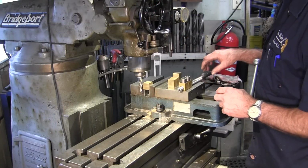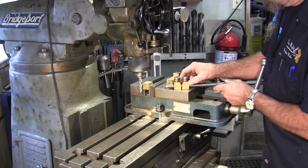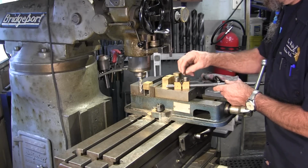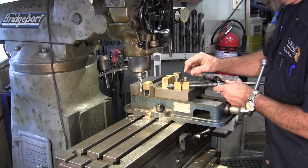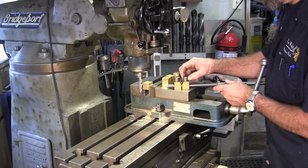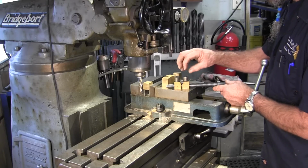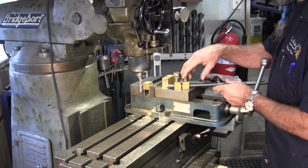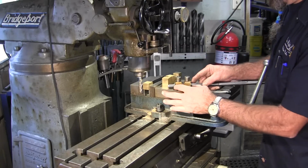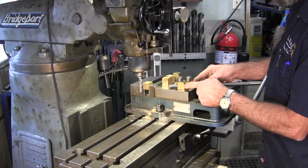We've got our blocks in here. We brought out our lead screw, and you can see here the amount of play in these threads. These are the round diameters that locate them into the cross slide, and they're made to have a little bit of adjustment like this, because you have this wedge block that goes down in and pushes these apart, and that's how you take out the play between the pair of threaded blocks. Now this is 8 threads right here, so I believe this gap is supposed to be 1/8 of an inch.